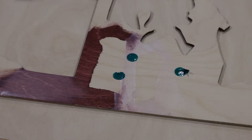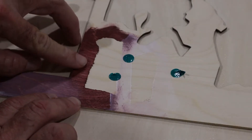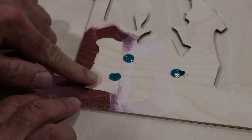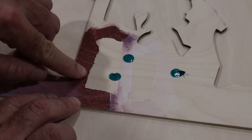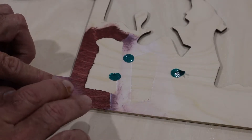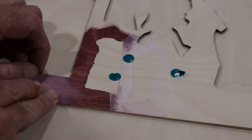Couldn't get it to work, so I've come up with another solution. I think it actually looks even better than what I expected, but let me show you the problems I was having with the gel stain first. Ignore the cutouts in the wood — it's scrap from another project — but here's gel stain that I've applied. I put down a piece of painter's tape right here and you can see that it bled right up underneath the edges of the painter's tape. I was pretty careful to wipe away from the edge of the tape, but it still managed to get up underneath there.